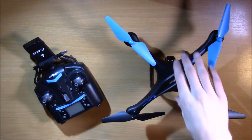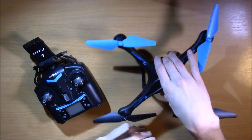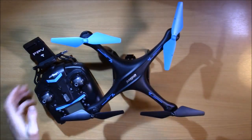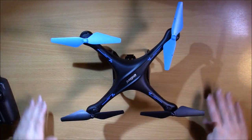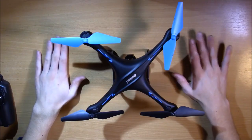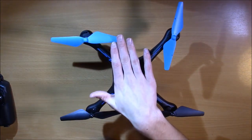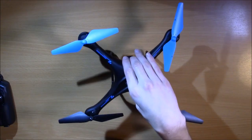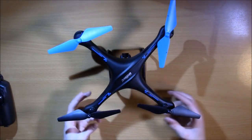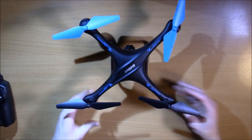What calibration does is it takes your drone and reads the gyroscope. The camera's at a little bit of an angle so this looks tilted, but this is actually a very flat surface. What it'll do is take this flat surface and make it the threshold for being level, so when you're flying, your drone will also sit level in the air. Now if your drone is really drifting and it can't be fixed by trim, you're going to want to use calibration.